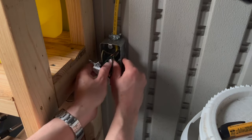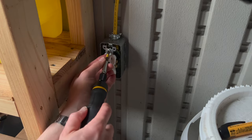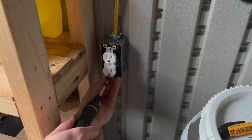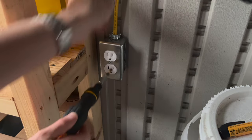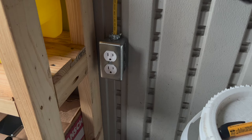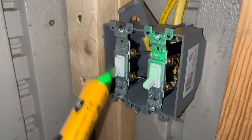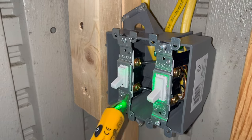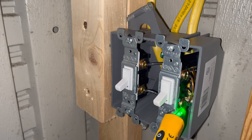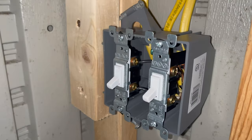Sometimes you really got to maneuver these wires around to get them all to fit. I'm going to go turn the breaker back on and then we'll check our switch box to see if we've got power. Power's back on and switches are off, but we should have two hot wires on the tops of both switches — yep. And then the wires on the bottom should have no power yet because the switches are off. We're going to leave those off for now because we have not hooked up our fixtures on the other end of these wires. I'll install the face plate.